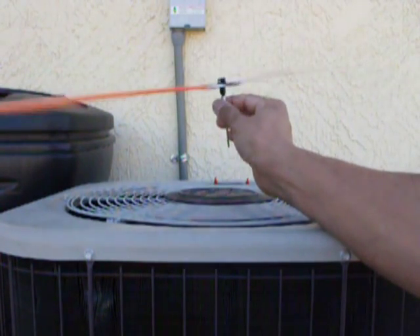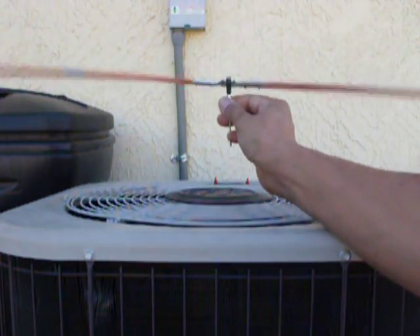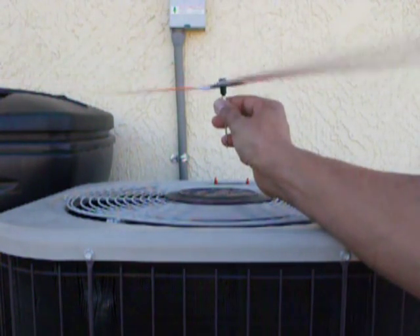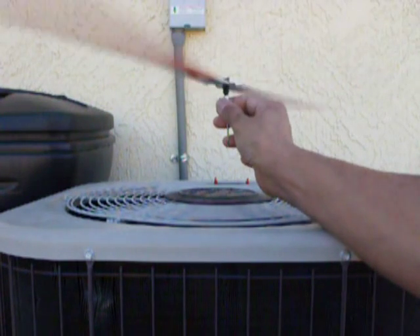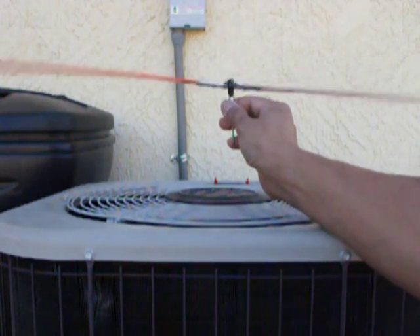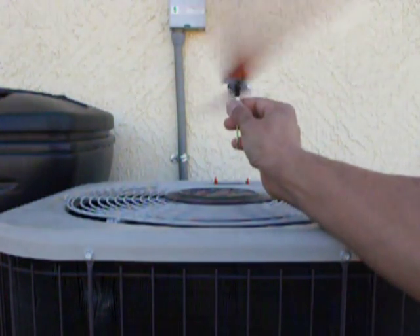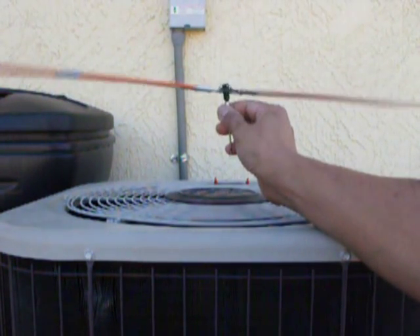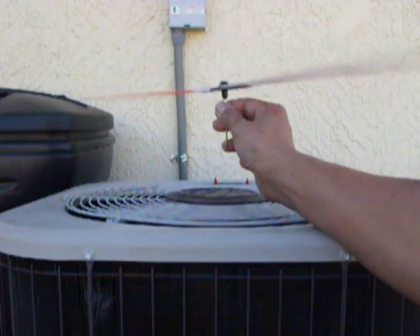When you control the blade they tend to lose speed. When you lose speed you lose lift and the autogyro tends to come down pretty hard on either side, depending on the direction of rotation of the rotor head.